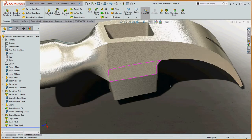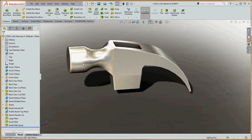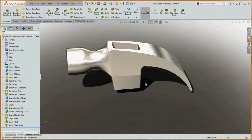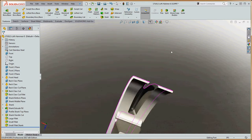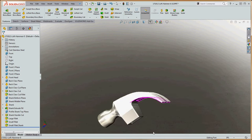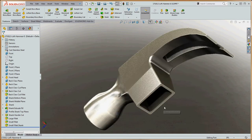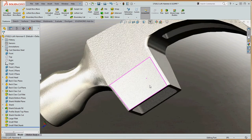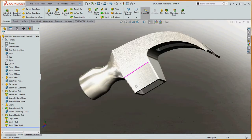It would be really hard to get something like this by simply using extrudes and cuts, and even a revolve feature could only approximate it. You can't really get the shape where it flares out in the back, where you have the claw where you can put this profile in to pull nails out. You also have a loft between the top and bottom in a lofted cut that gets a little bigger as you go towards the top, allowing you to put in a wood stock handle and a wedge to expand it at the top.